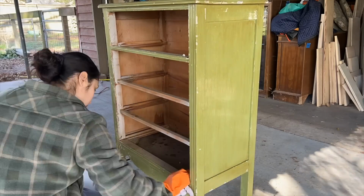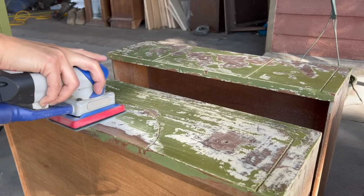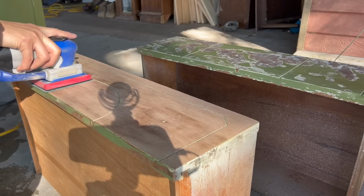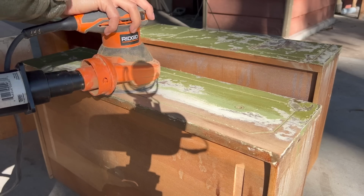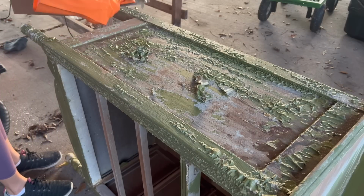By then I figured it'd be best to try and sand the old finish off instead. When my surf prep seemed to be having trouble removing it, I switched to my orbital sander instead. Although it worked much faster, it still was not fast enough as I would have liked, so I switched back to trying a second round of stripper.